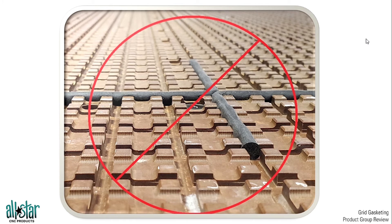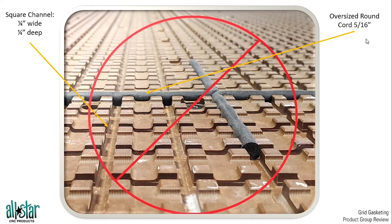Here we'll take a quick look at why we recommend square gasket for square channels. Here we have a square channel, quarter inch wide by quarter inch deep — a very common channel size for today's router tables — however it's very often supplied with an oversized round cord, a 5/16 round cord. We need that 5/16 to be taller than the channel in order to stick out about a 16th of an inch proud above to produce that seal. However, the fact that it's 5/16 is also wider than the channel, and when you ask a human operator to get that 5/16 cord into a quarter inch channel, the only way they're going to be able to do that is stretch it or mash it into that channel, and you can see the varied surface top across a 4 by 8 table. No way you can get that in there consistently, and that's what's going to create those gaps, those uneven surfaces on the top of the gasket as well as vacuum leaks down under the gasket. These round cords in these square channels do not fill that channel properly — ineffective in terms of creating maximum vacuum clamp.